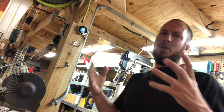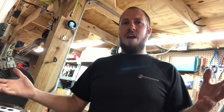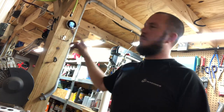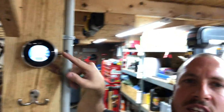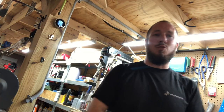I'm going to spin the camera around and show me using this fish tape on the project. I have an outlet directly beneath this, with an outlet box here. What I wanted to do was protect this Romex as it runs up the side and all the way over above my light, so nothing can bump that Romex and electrocute something or short something out. I also have the Nest thermostat wire ran right through here — I drilled a hole and ran the thermostat wire through to have it protected as well. So let's get down to it.